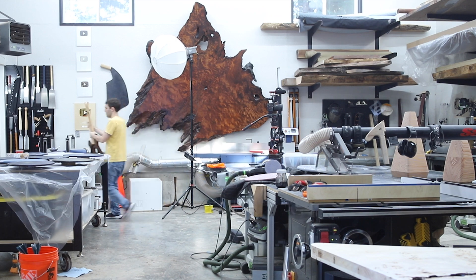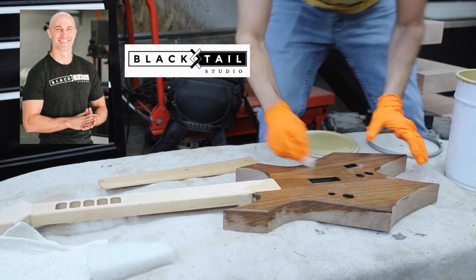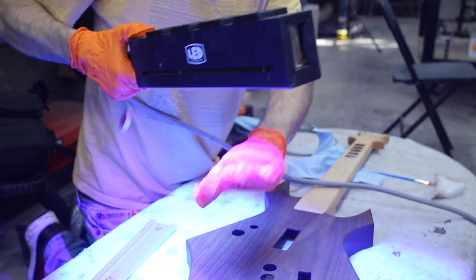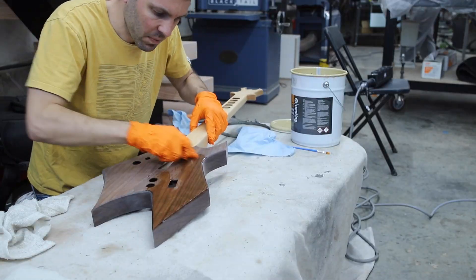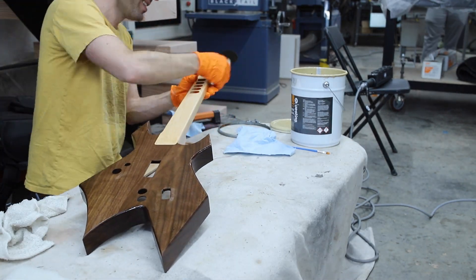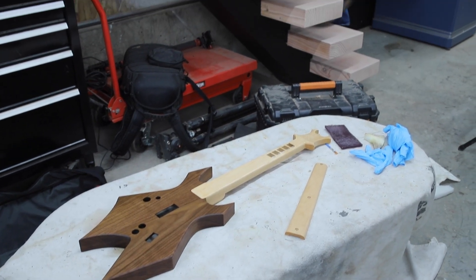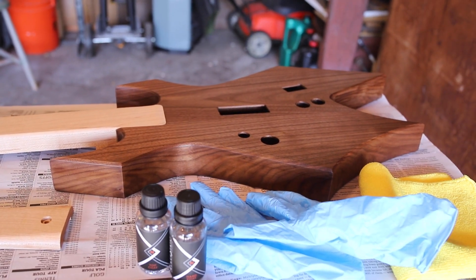If you're a YouTuber in Portland making cool things with walnut, there's one channel you have to know: Cam from Blacktail Studio. He has a special UV light curing finish that he was kind enough to let me try, which was perfect because we didn't have time to wait for things to cure over a week. You apply a thick layer of liquid with a rag or brush, wait 15 minutes for it to soak into the wood, then wipe it off. The UV light — probably the most expensive tool on this project — only needs to shine over the wood for about a second per area and the finish is instantly cured. I added a second layer for protection. And if you don't have the UV light, you can use the sun — but in the Pacific Northwest, we need all the light we can get. I finished with his N3 Nano Finish for an extra layer of protection and sheen that really makes the grain pop. Thanks, Cam.